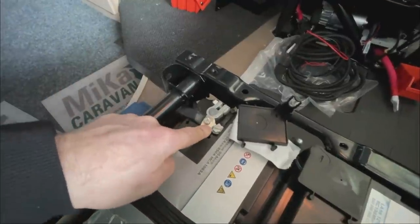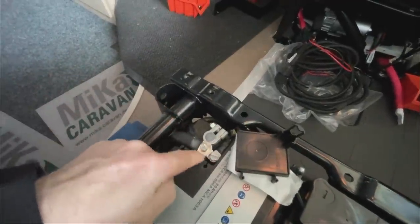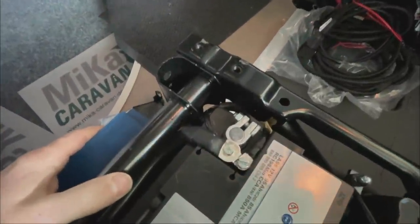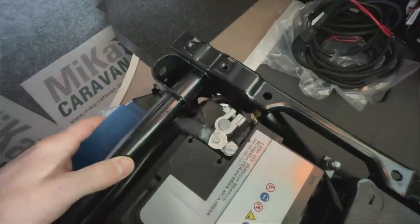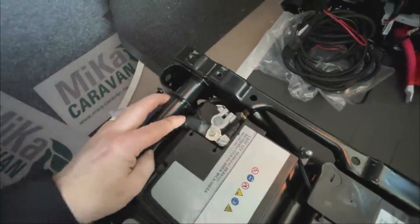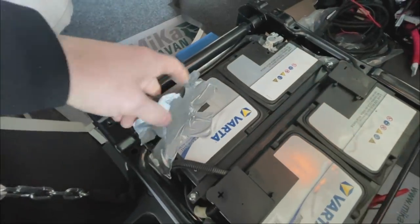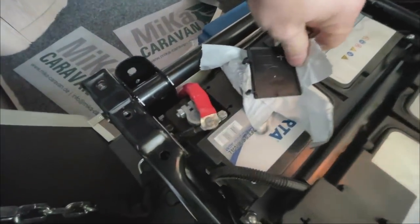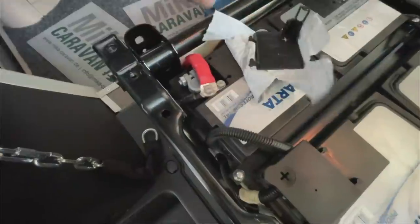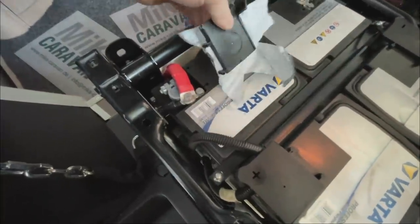You see – the screw without a washer, directly on this... Honestly, people, this is anything but professional and nice. One can really do this differently. At least it is nicely insulated here, but that is also the only good thing, because there are countless cables on here – I think two or three cables going into one terminal. And if I open this and pull it down, it looks exactly the same here, because through the thick cable it no longer holds properly since it sticks out over it. Out of sheer doubt they then used Panzertape to stick the cover on.